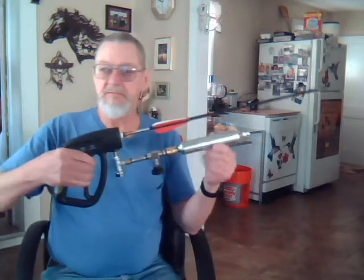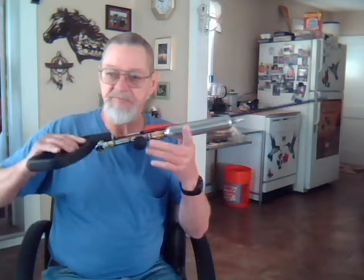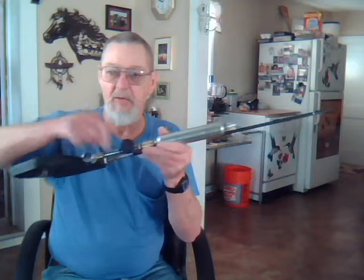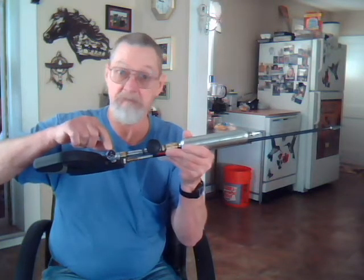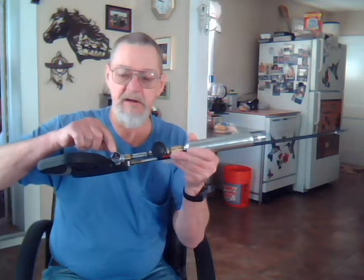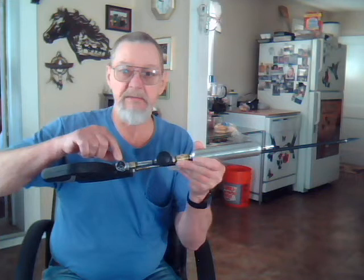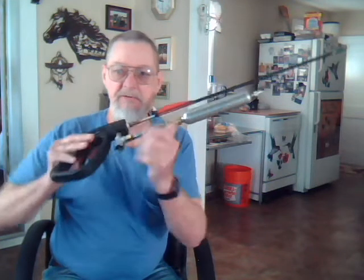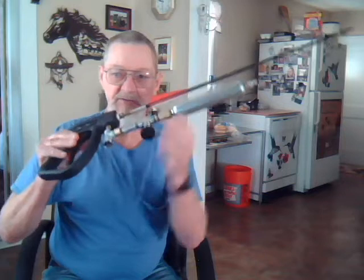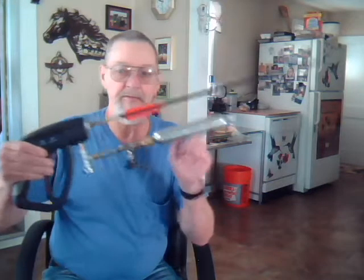You pump it up to 2,000, then I can open this little needle valve and watch my dial — I can adjust how much air I want in here. To shoot this arrow I'm using about anywhere from 800 to 1,000 pounds. I open the needle valve a little bit, put a little air in the chamber, close it, and shoot.